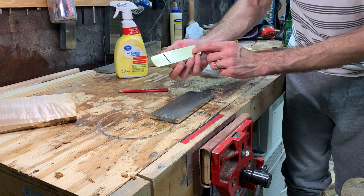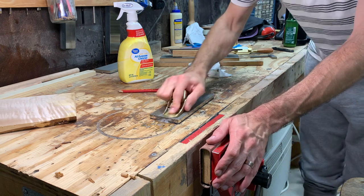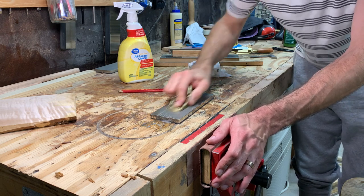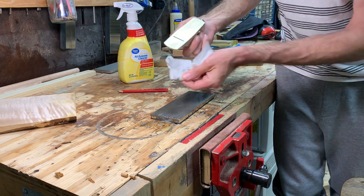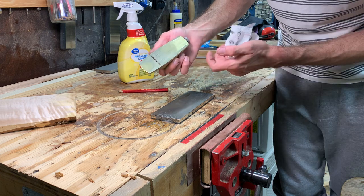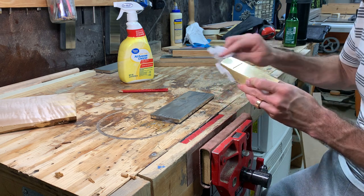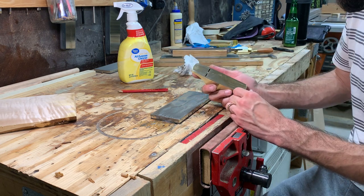The toe is almost done. I don't think the heel is that important, frankly, if you're using it for smoothing. It's touching before the mouth, it's touching after the mouth, and it's touching on all four corners. For the sake of using it as a small smoothing plane, that should be plenty. It's not a plane like a jointer or even a jack where you're looking for full length registration — this one is for detail work really.